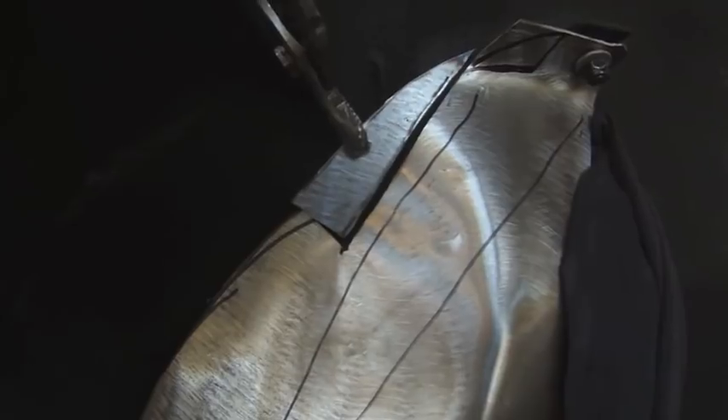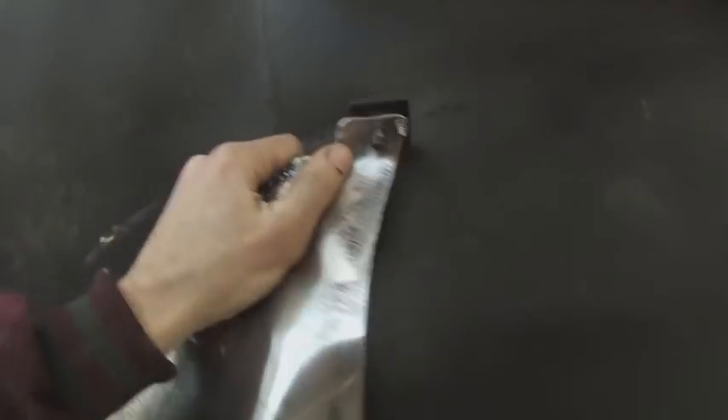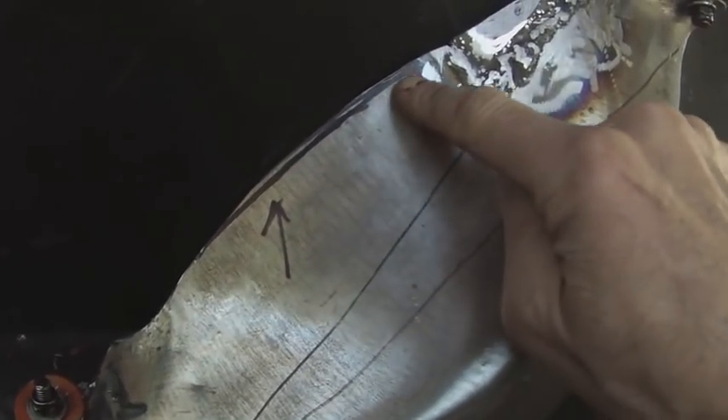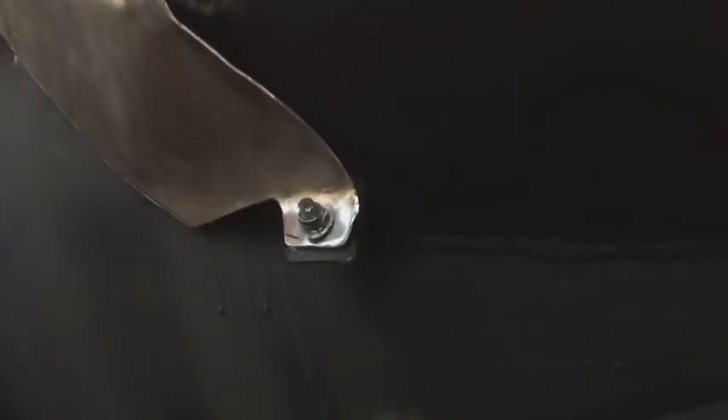Next I'll weld this piece on and then cut this off. In order to get this piece on, just slide it on there, then you have to press the piece in just a little bit — it's easy to do. And then it rotates into there. I've still got one more thing to do: I'm going to trim this because that's too close to the hull for me. But other than that it doesn't touch the hull anywhere. And I'm ready to put some coal tar epoxy on it.